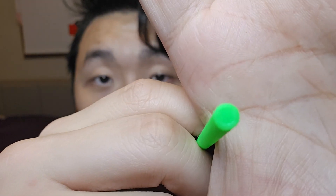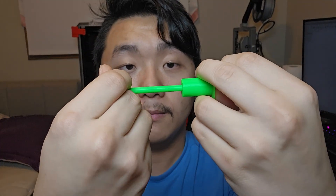The reason why I don't really like printing rods flat is because of the fitting or the tolerance — you gotta do some post-processing for these pieces in order to get them to fit into the hole you're trying to plug them into. I did print this piece; it's a 5 millimeter hole, actually 5.15 millimeters — 0.15 millimeters tolerance. I'll show you the fitting right now.